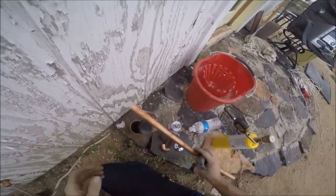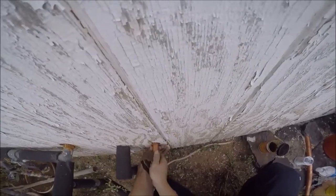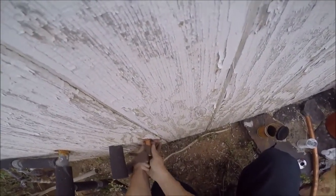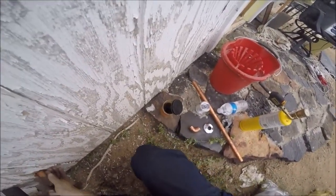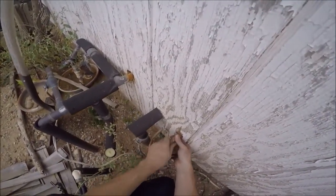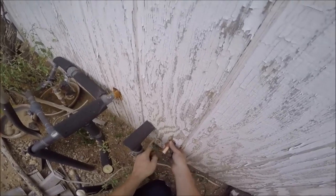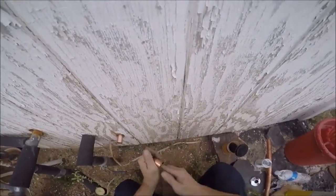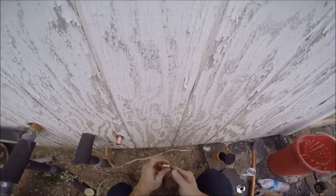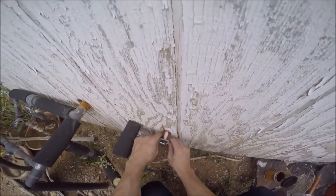All right. So, by code here in Arizona, this has to drain by gravity to daylight. So you gotta solder a 90, because it has to point downward. That's what I'm trying to achieve here. I forgot a fitting brush. Let's use my own. I was gonna put a scutcheon on too, I like the scutcheons. Let me flare it out a little.